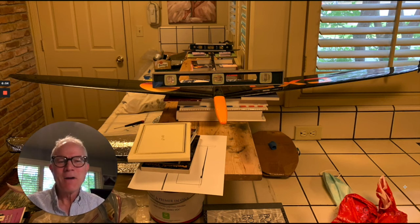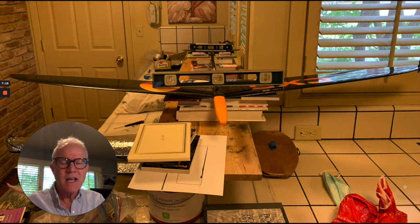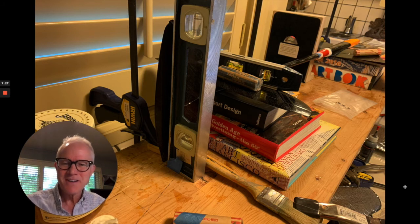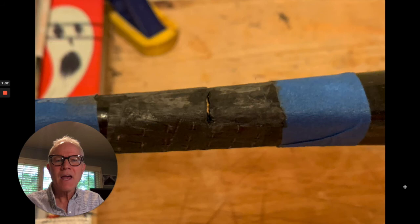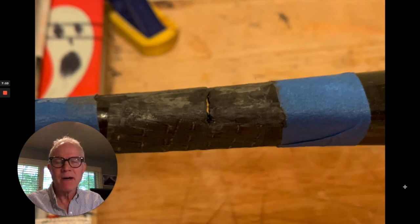So that's still kind of wobbly at that point. My other tricky technique is I use books and levels — and from this view they don't really look level, but they both should be level and lined up with each other. I fairly carefully make a kind of a little bed for the whole thing to set up, because it does wobble a bit when the first piece goes in. This is a way to get it lined up visually. I continue this even on the fin and on the stabilizer, and I use several levels to do that. I use rolls of pennies as little weights, so the whole thing is lined up. When it's finished, there's my patch on the lower part, and there's the part that's still cracked. I got half of it locked in — you could make a one-shot deal by wrapping the whole thing at once, but I just felt better about lining this up first.